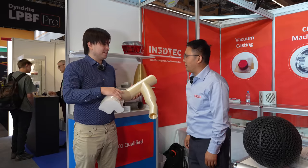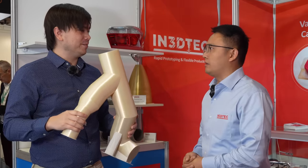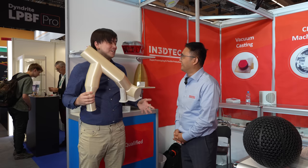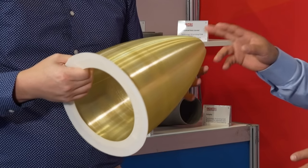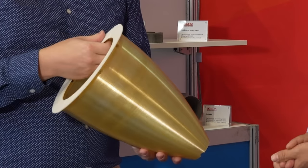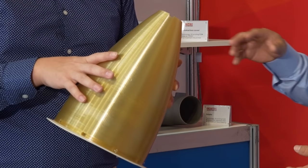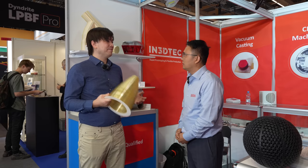What's the plastic that you're using here? It's PAEK. Do you know the melting temperature of that plastic? It's almost 410°C, and the heating chamber is almost 200°C. You could boil water in there. Printing this material needs very industrial machines. Also this material, PAEK — what's the difference between PAEK and PEEK? PAEK has higher temperature resistance, and it's much easier for printing. Since you have all the machines in-house, you have the expertise, so if you have questions about these technical materials, you can just send them an email.